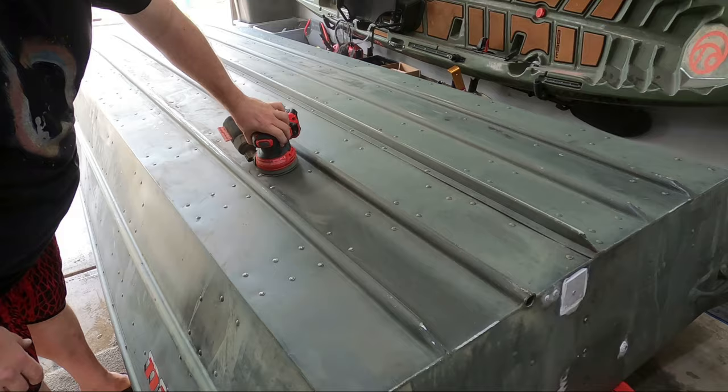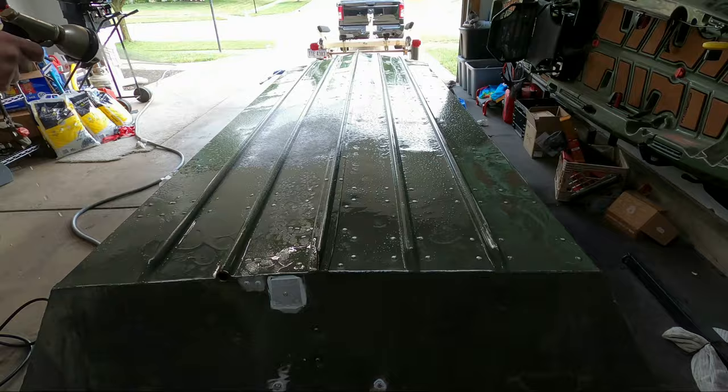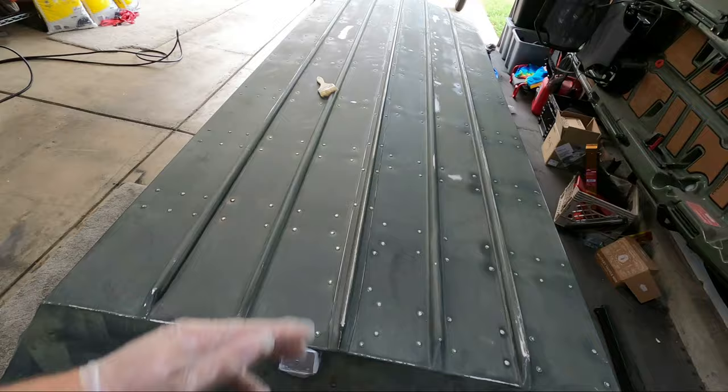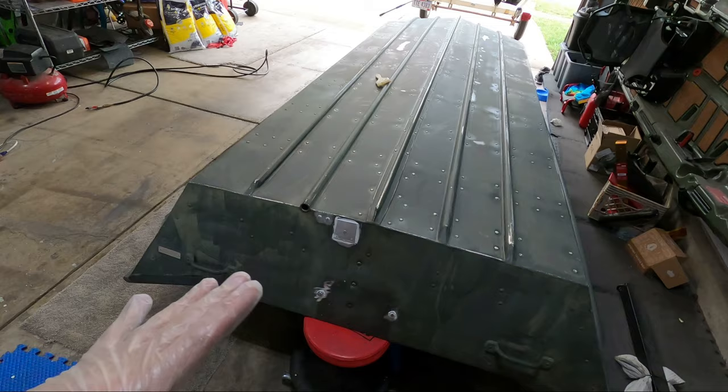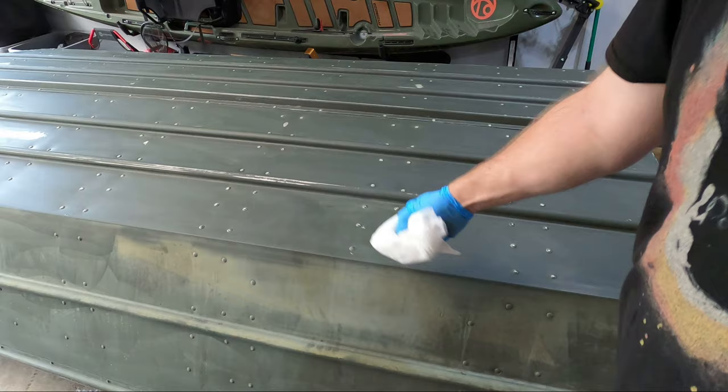The bottom has been completely sanded down. I think we're going to have to give this one more wipe down with all the contaminants we pulled up with the sanding. I'm going to hit it with the degreaser first and then come behind with the hose to get this thing completely ready for bottom coating. It's been a long day getting this ready — this has been washed, sanded, degreased, washed again, and now we're going to use acetone to give us the best surface prep we can get. Scrubbing with a clean white paper towel — nothing. We are good to go.